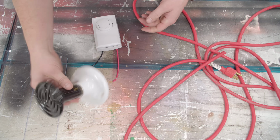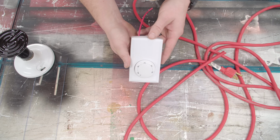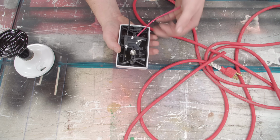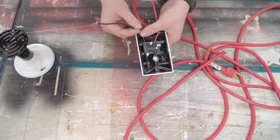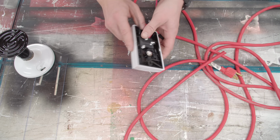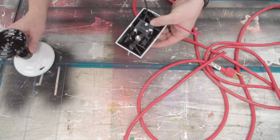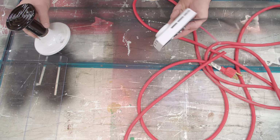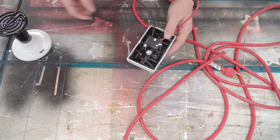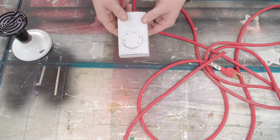So I'm going to control the heat source via this thermostat. It's a basic, single pole thermostat. Black wire is your load, so that's your power in, and if it reaches the desired temperature to allow current to go through it, you'll have power on here. So this is the way we'll power this particular heat source. So this little cat house is going to have a thermostat in it. Just heating though, no air conditioning.